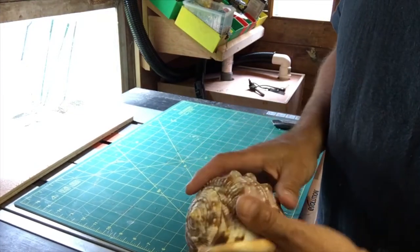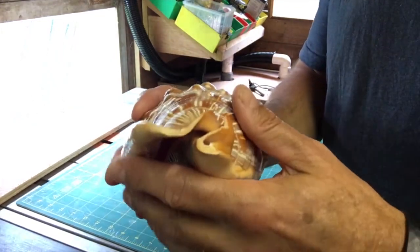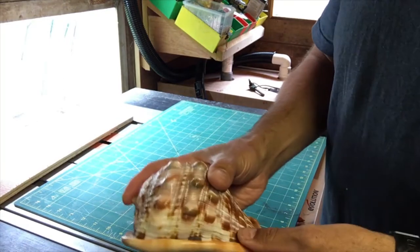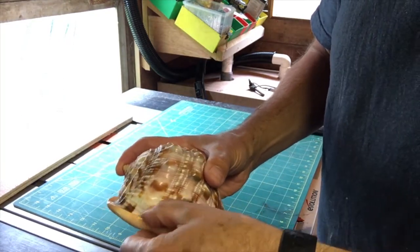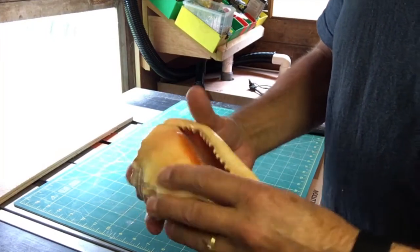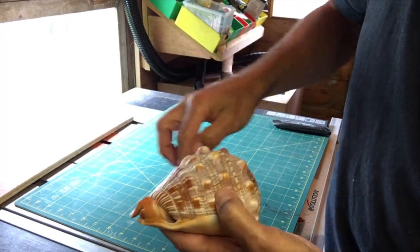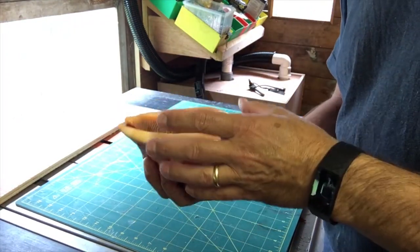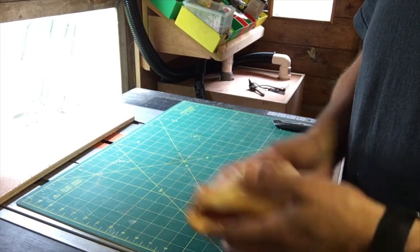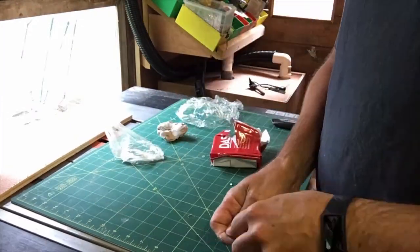Okay, so it's a bit of an awkward shape, so we're going to have to make two molds — one for the top and one for the bottom, the bottom being the most difficult. We've got some breakage there, or maybe that's how it grows, so I'm going to have to use some modeling clay in there. Also this ridge here is a bit too deep with a bit of an overhang, so I'll need clay there as well. I'll fill up the opening in the bottom and then make a mold for the bottom and a mold for the top. Then I've got to find a way of joining them together — make the top half, then the bottom half, then find a way of fixing the two together. I think I better buy some plasticine because that might be easier — but I won't do that on this one, on the next one.